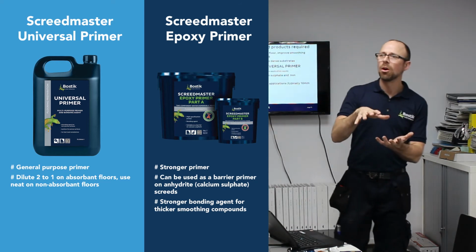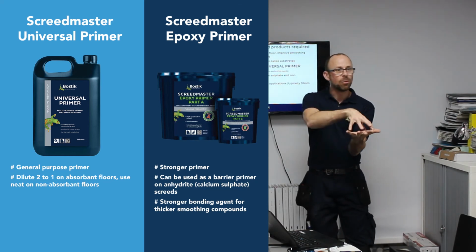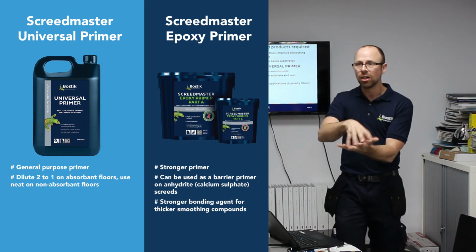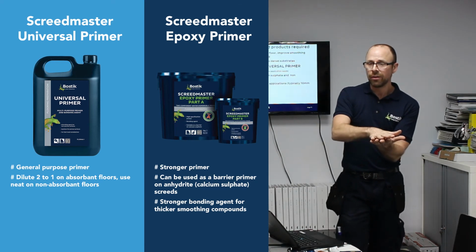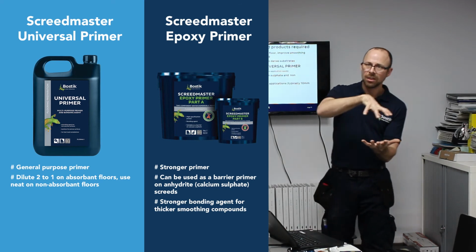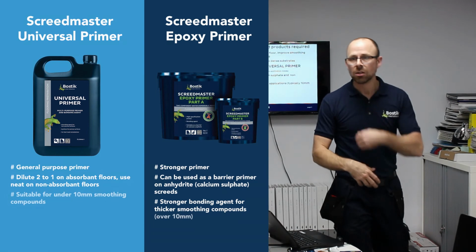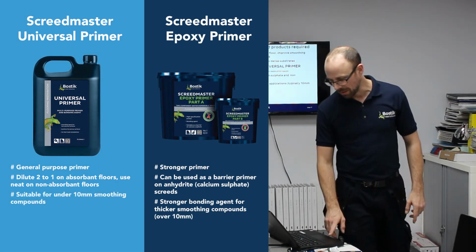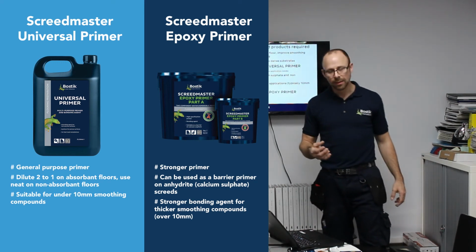So when the smoothing compound dries, it creates tension. It pulls at the floor underneath it. So if it's a weak floor underneath, it's going to pull and could pull it off the floor. If you're going really thick with the product, then the tension is even more. So you want a stronger primer to cope with that tension created in the drying process. So over 10 mil, you want to go with epoxy primer. Under 10 mil, universal primer. So we've got 2 primers in the market.